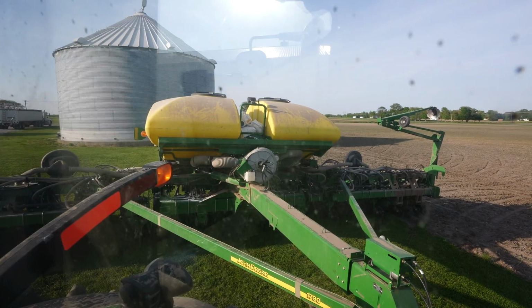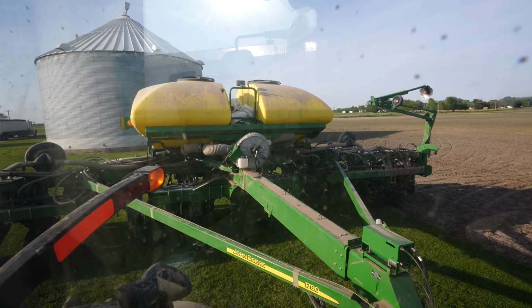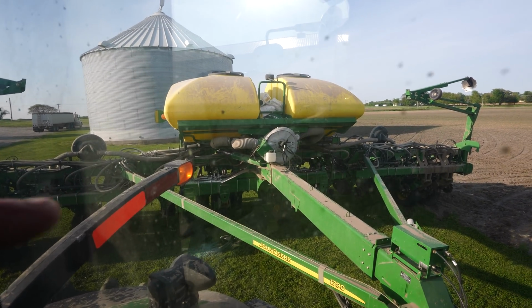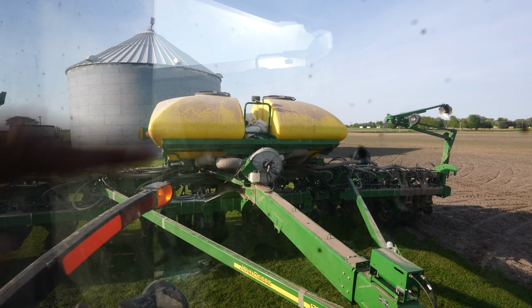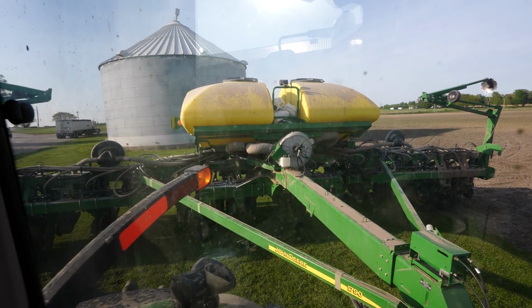We got the planter dumped. We had more than an excessive amount of beans in there. I also noticed that the outer section of blower line has cracked open. We replaced the one right out of the blower last season. We replaced the long one from the tee to that tank earlier in the season, and I guess it would make sense that that one was due to break.